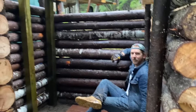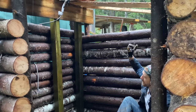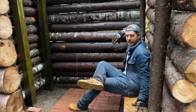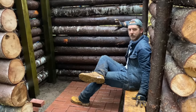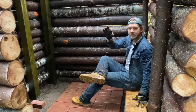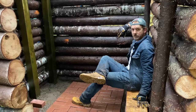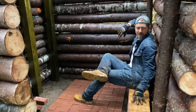Yeah. And the hot water for the shower is going to come from the wood stove, which the chimney is right there. You guys have seen it inside the yurt. So I've got a water jacket coming that will basically tuck like a duvet around the wood stove with little threaded emitters, and I can put copper pipe from that and run the hot water directly from the wood stove to the shower. Yeah, that's what we talked about at the beginning of the video. Oh. Last day of the game.